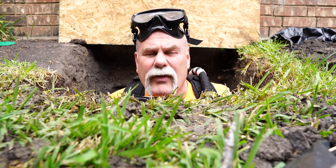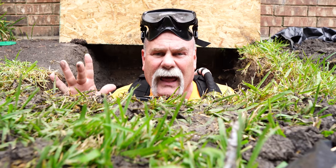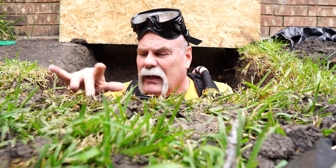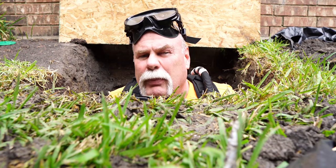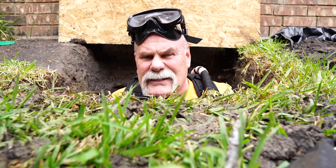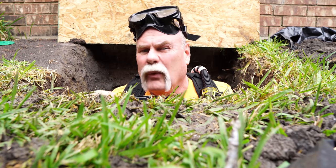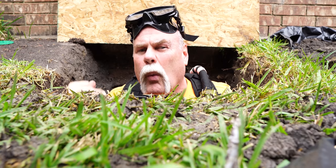The reason these repairs are so costly is we've got black clay — that's what the houses are built on here. Normally it's pretty stable, but when it gets wet or dry it tends to shift and move around. We've talked with foundation people and consulted with them to figure out the best approach.